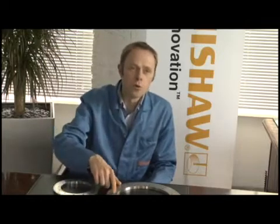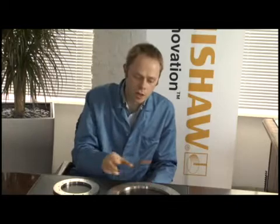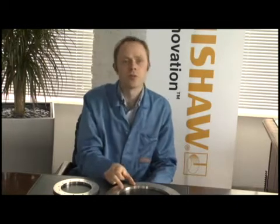The bolts on an REXM ring provide the clamping force which prevents the ring from moving once it's been centred. Larger rings have more bolt holes which increases the clamping force and also ensures that the distance between clamping points is not too great.